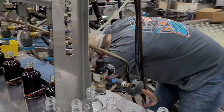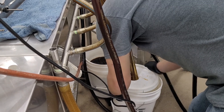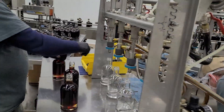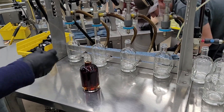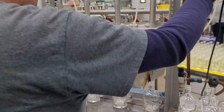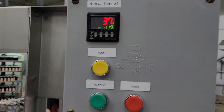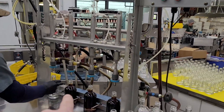Nice. Kyle just replaced our overflow buckets. He's got it figured out. So not only are these guys filling, they're capping and inverting. That's amazing how fast they go. So while this is filling, what Dean does is he gets his next four bottles ready. He's got 11.9 seconds between each fill. This machine replaces a person with a valve, and you get a perfect fill every time.